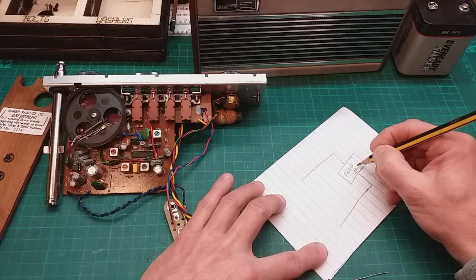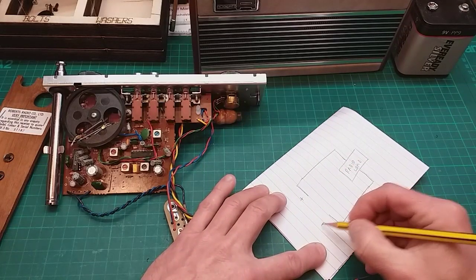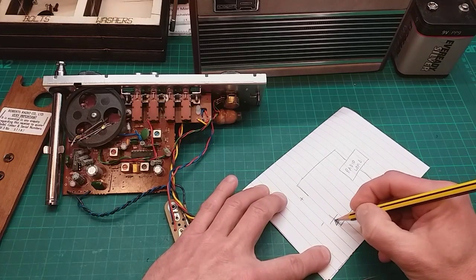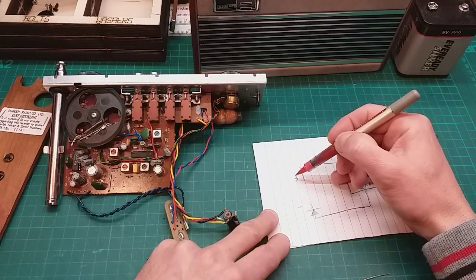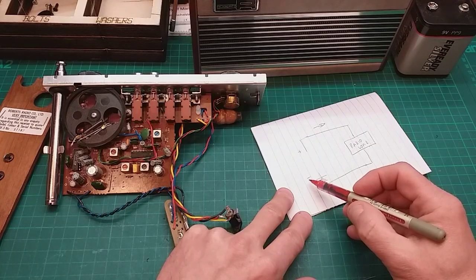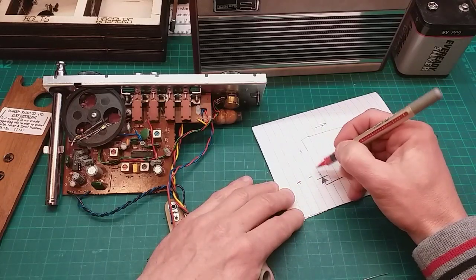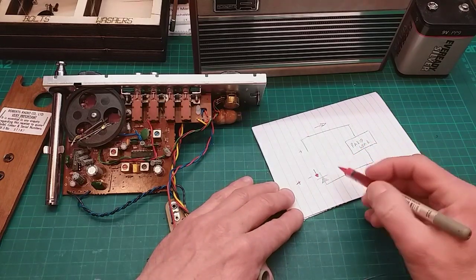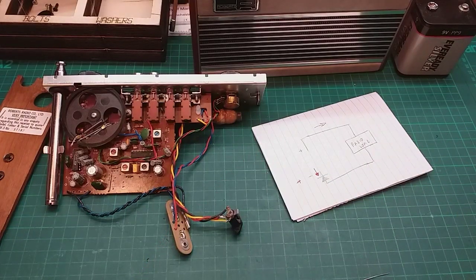So radio, or the load, and we said positive and negative, and I want to put a diode in that way, I think, because all being well, if the radio's working right, the current's going this way, no problem. If somebody put in the wrong pin, say somebody put in positive here basically instead of negative, it should hit this wall or valve of the diode and go open circuit there and stop any current going into the radio and damaging it that way. I think that's how it works.